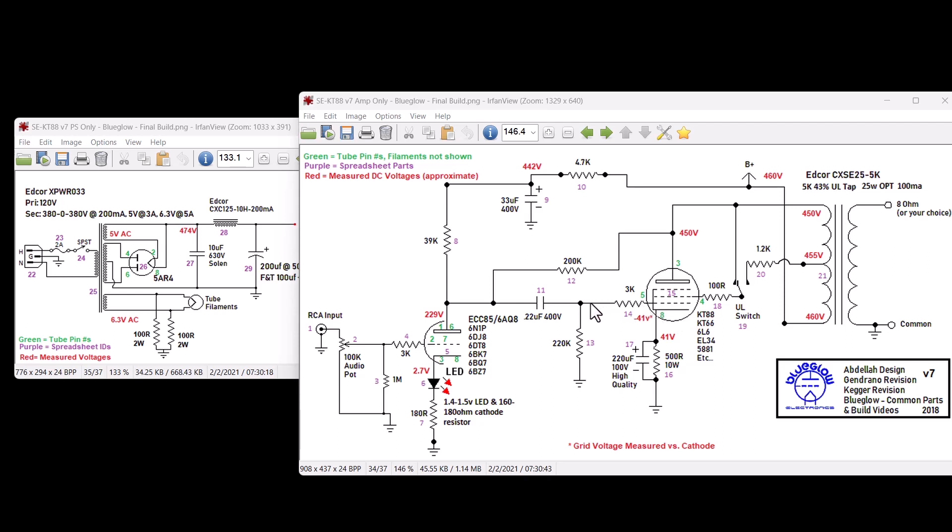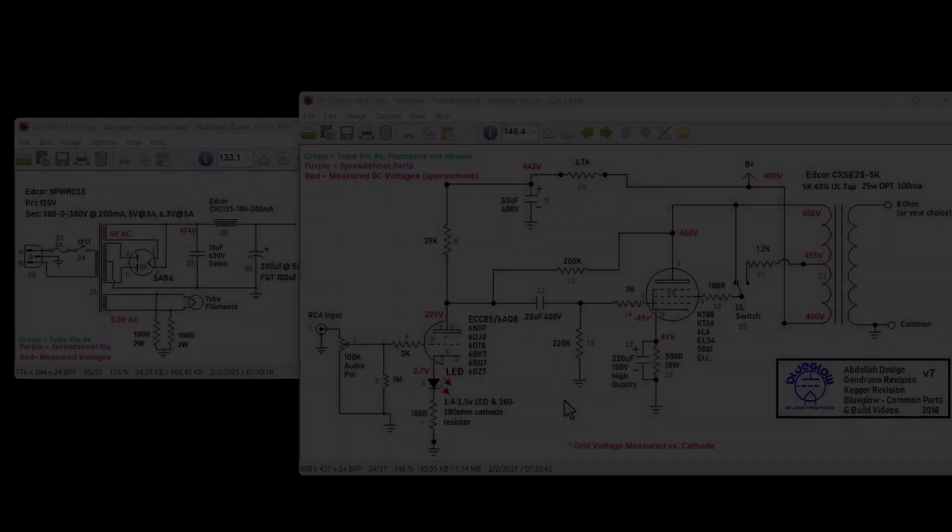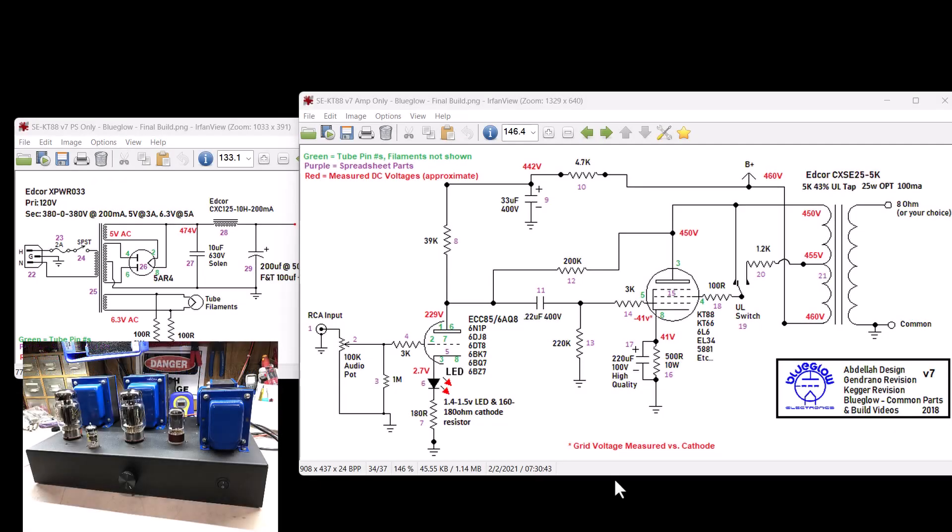Put one probe on pin 5 and the other over to see if the resistor is still 3k. Measure to ground to verify it's still 220. Walk through the whole circuit. Not all resistors are easy to read when other things are in parallel, but what you're really looking for is shorts where there should be none. Use your digital multimeter on the continuity/beep setting and check between lots of points and ground, looking for anything shorted or any component value way out of whack.